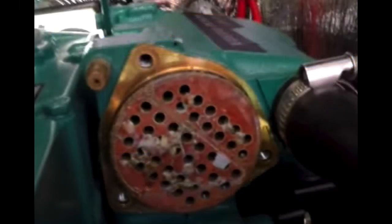This is where the salt water goes through the heat exchanger and cools the coolant in the engine. Any blockages in the heat exchanger will have a detrimental effect on the cooling of your engine, so keep them clean and clean them out on a regular basis. Check out our video on cleaning heat exchangers — there's a link in the description.